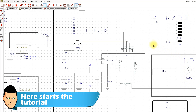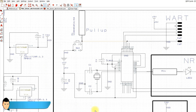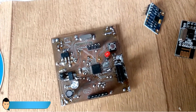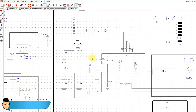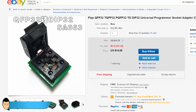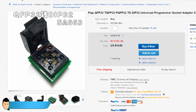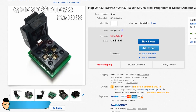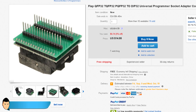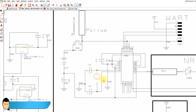This is the schematic you need to build in order to properly use an ATmega SMD chip. In my case I've already soldered the chip to my pre-made PCB. If you don't have a PCB, you won't be able to connect wires to the SMD pins, so you'll need an SMD socket adapter — you can buy it from eBay. It will help you make the connection between the Arduino Nano and the SMD chip using jumper wires and a breadboard.